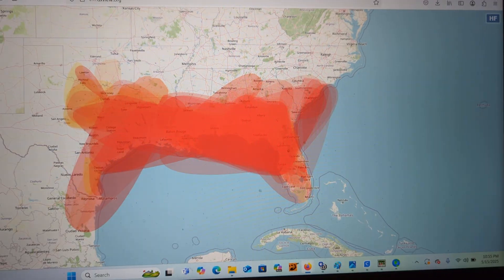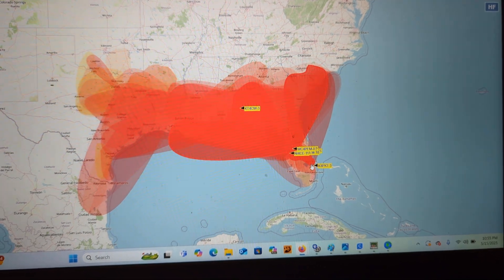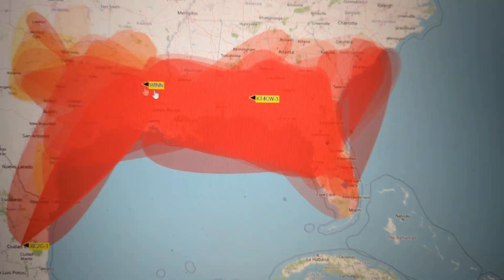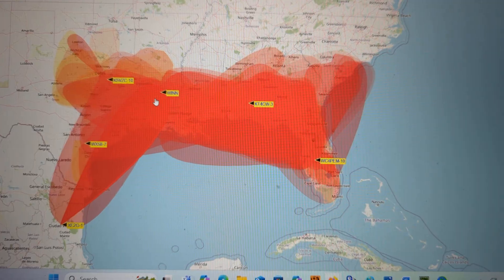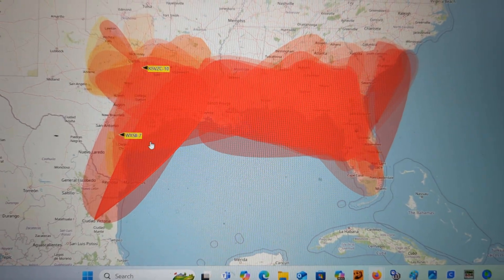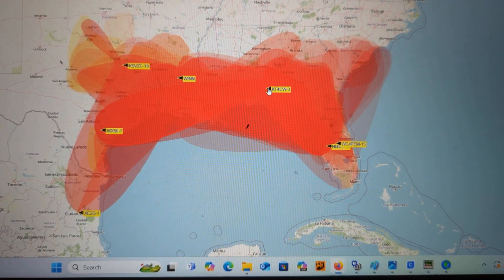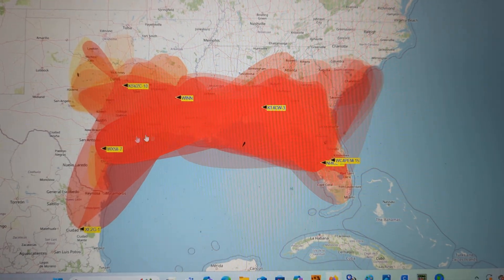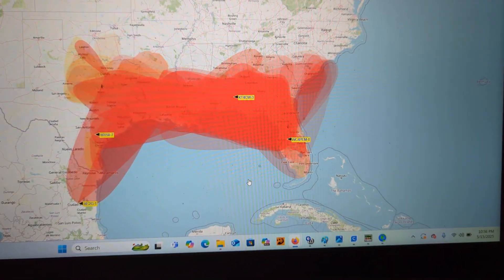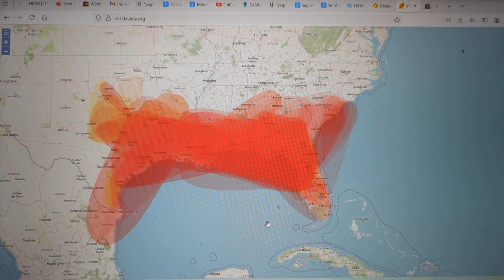The way I verify it is pskreporter.info. What this shows is that every one of these stations — for instance, here's NI4CE — that NI4CE digipeater is being received way over here. A station like WX5II-7, the dash-7 meaning handheld, is being received at great distance at KT4CW-3. So basically you can tell if that packet was received on APRS, there must be propagation. As I've said before, this propagation map shows real-time contacts — it is not some terrestrial solar data that says you may have something. This is real.